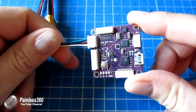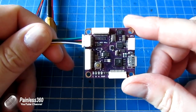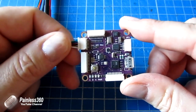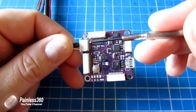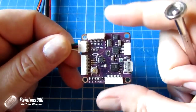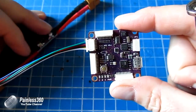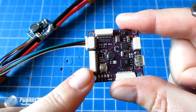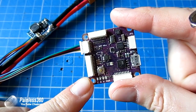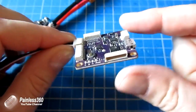This little bit of technology sits in between the battery and the power system, and not only sends the plus five volts and ground needed to power the APM itself, but also cleverly sends information about the voltage of the battery and also the current being pulled by the craft to the APM, so that you can get that over the telemetry link or show it on things like the Mavlink Minim OSD displays.